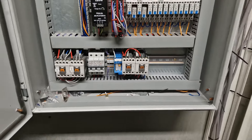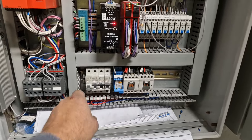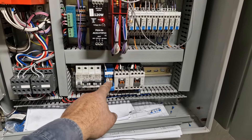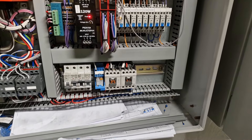Everything is completely and utterly independent. So if I drop the grid power in this panel, for example, watch these two swap over — we've got a break-before-make. Now this one here is a priority relay; this one was always energized by the grid, and then with the usual interlocks between the two contactors.